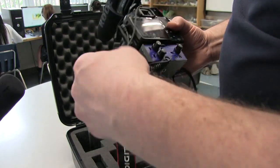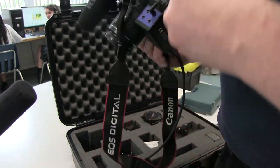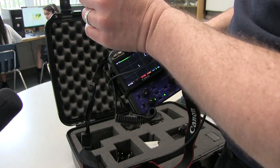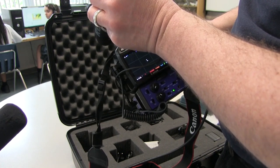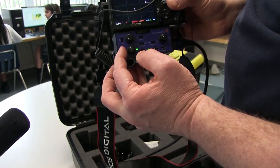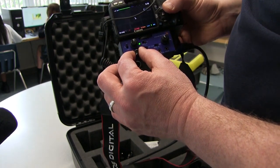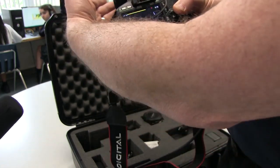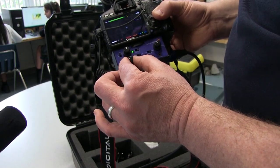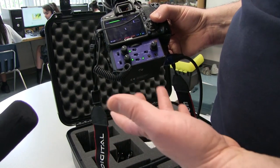Next thing: using two microphones. I've hooked up a second microphone and I'm going to plug this into the other channel. We've got the right channel where you can see the R with the XLR cable plugged in, so I'm going to plug this into the left side. I'm going to turn this microphone on and set it to the middle. I've got this meter turned right off and I do have it set to high. I'm going to start to bring this up and you can see the top one is beginning to show. I'll turn the right channel off so it's not distracting — and there you should be able to see the top is recording just on this mic. If I tap it you can see that it's just that mic; if I tap the other microphone nothing's happening because we've turned it off.